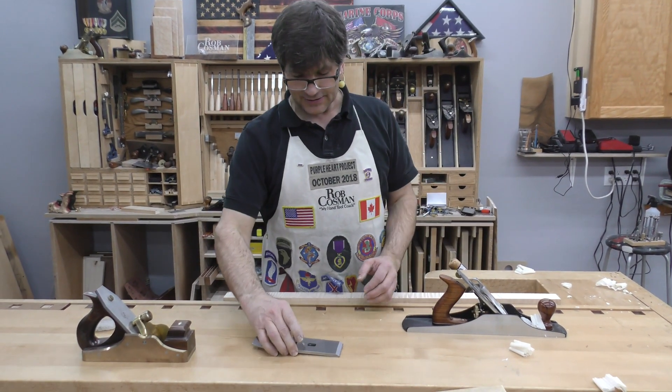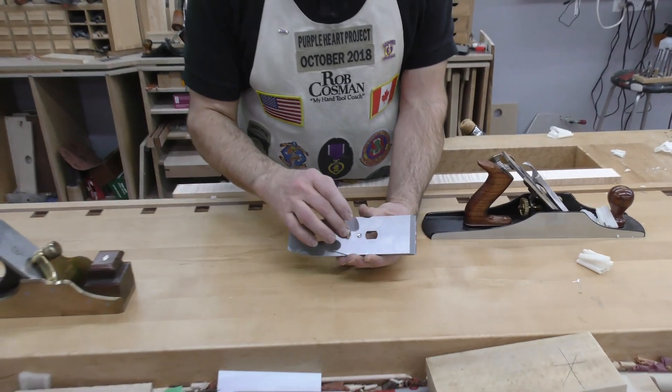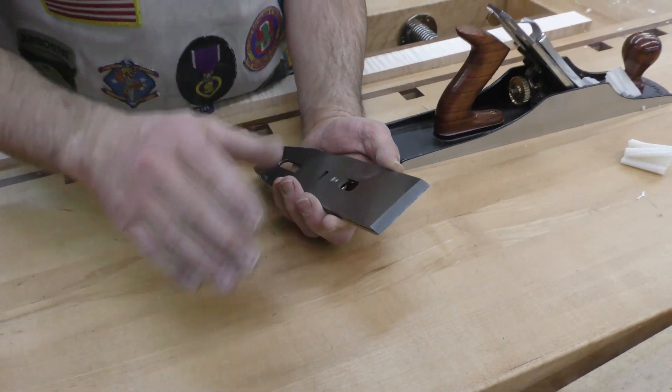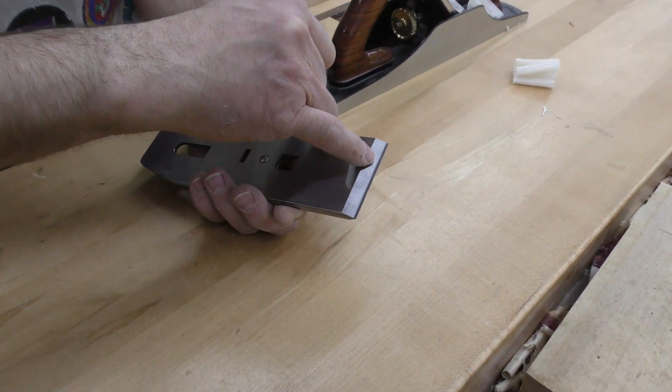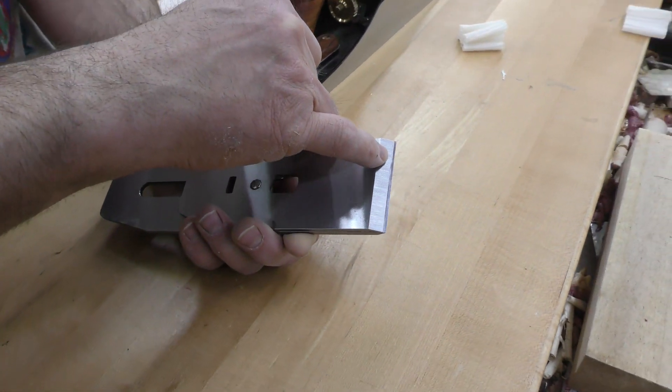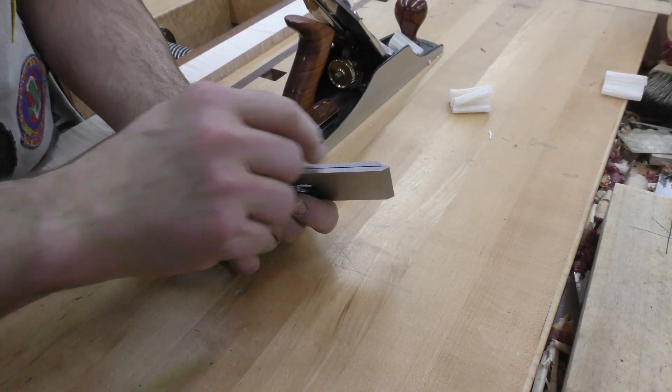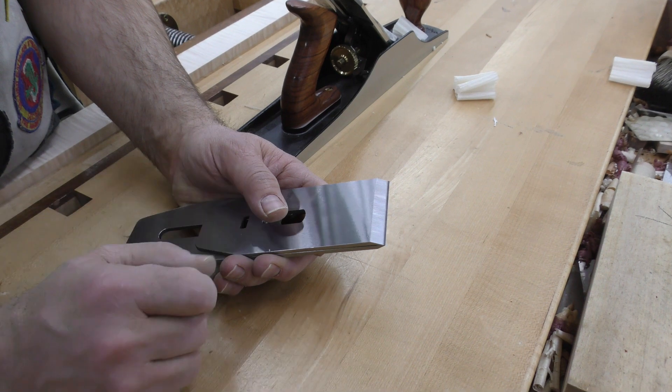What we're offering is a Wood River blade, including the chip breaker. We've gone in and used Shapton from start to finish, which is going to give you this beautiful little back bevel. It's a little better than a 16th of an inch wide, and if you could see it on an angle, you'll notice it's 20 degrees. We've polished it right up to 16,000.